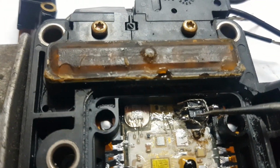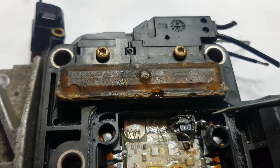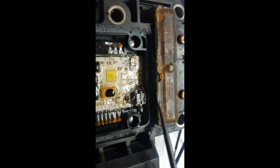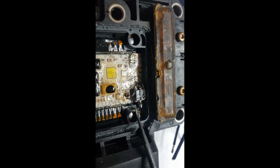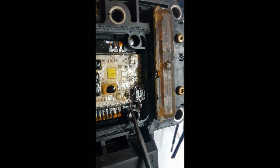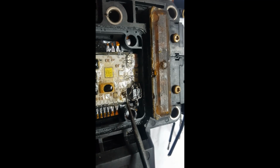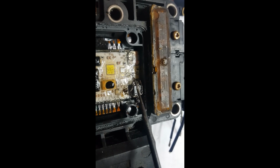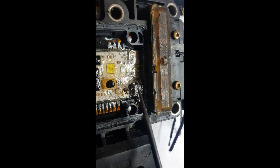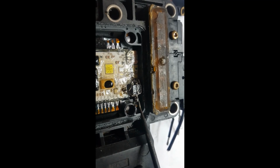So this is the transistor right here. The legs are on this side, and as you can see, this leg comes over, not touching here, but over, to solder to that point. This leg on this side comes over and solders on these 2 points here. The ground comes from that leg there, that point, to this leg, to the base, which is all ground.